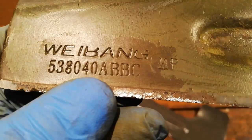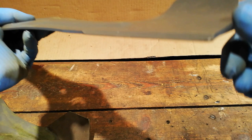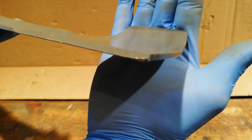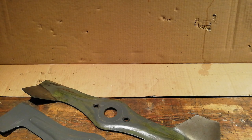This blade bags amazingly, so get one of these. I haven't even used the stock blade that came with the machine. That's the part number for the BBC version for the 53 SSD BBC. Quality-wise, the stock blade that came on it has an absolutely awful edge - it's so blunt. Look at the state of that corner, it's almost like it's been sharpened, then dropped and painted. Even if you don't get a high lift blade, give the stock ones a sharpen. Definitely get one of these high lift blades - it bags amazingly.